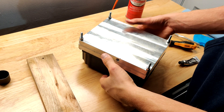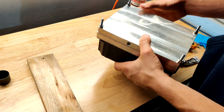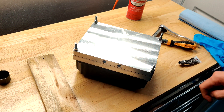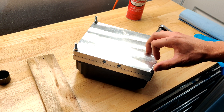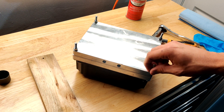Once you've wiped away all the excess, you're pretty much done. One thing to remember is that you will have to remove these bolts when you mount this. You need at least 24 hours of curing time for the sealant, so keep these in for at least 24 hours before you take them out to mount the inverter and chill plate wherever you're going to put them.